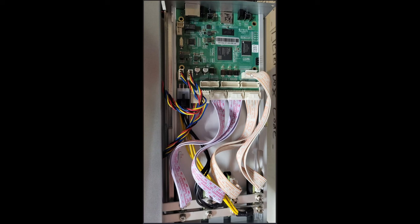And it's easy to overlook because there's boom, 1, 2, 3, and you skip these three. Do not plug them into this. Your hash boards won't show up. So plug your fourth ribbon cable that's coming off the hash board right here into this port right here, okay? Just wanted to make sure you guys knew that. If you see it in the video going forward, that's incorrect. This picture is correct, okay?